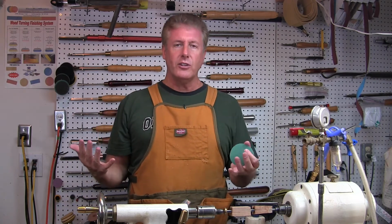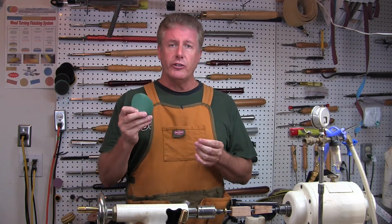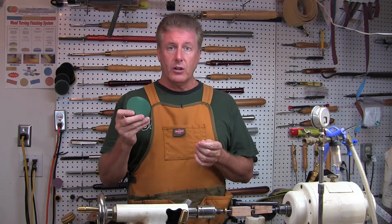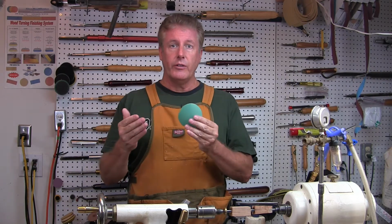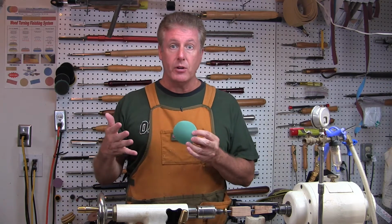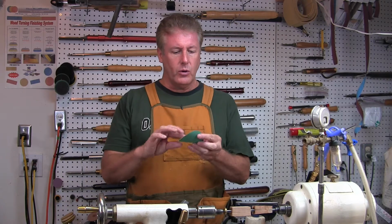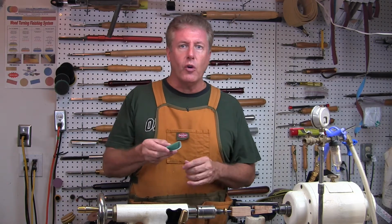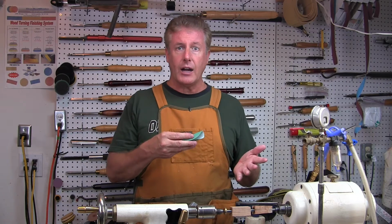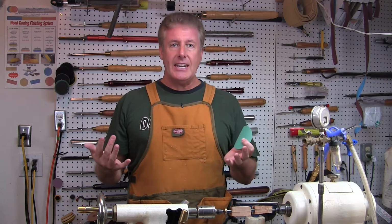The disc is only as good as its weakest component, right? So you've got a very durable backing with the mylar backing discs, the Greenflex discs. Also, because it's on a mylar film as opposed to paper, you can also wet sand and dry sand with the disc. Very durable, very usable. You can also hold a shape, hold a form if you're working maybe on the inside of a box, something like that. The grit range is from 80 grit to 800 grit.